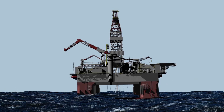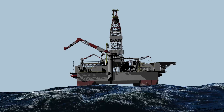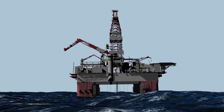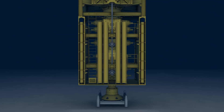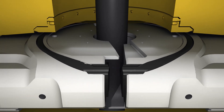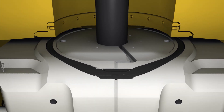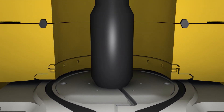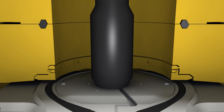If there is not sufficient time to pull the drill string out of the wellbore, the operator performs a disconnect sequence, which will detach the rig from its connection to the ocean floor. When this occurs, the control system is designed to close the pipe rams around the drill string to seal the wellbore and help prevent wellbore pressure from escaping. Then the drill string is lowered until the tool joint rests on top of the pipe ram block, located below the shear rams. This can prevent the drill string from falling into the wellbore when the drill pipe is sheared.